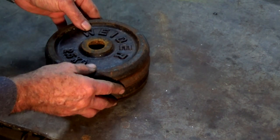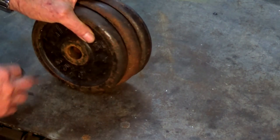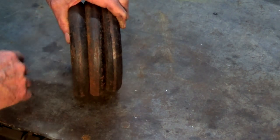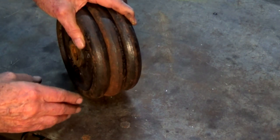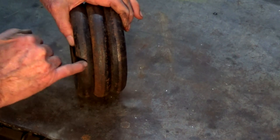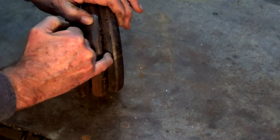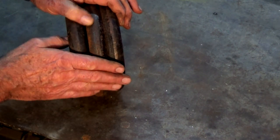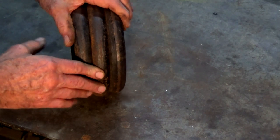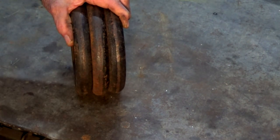moulding metal. And I had four of these cast iron weights, and my original plan was just to mount these loose on some sort of an axle and just let them freewheel and roll around the bottom of the drum. But because I had these curved edges, I started to worry that the green sand was going to get wedged into the spaces between the wheels, and it was going to build up and was just going to become a chore. You'd have to clean it, wire brush it and whatnot. So I rethought that whole plan, and I'll show you what I've come up with.